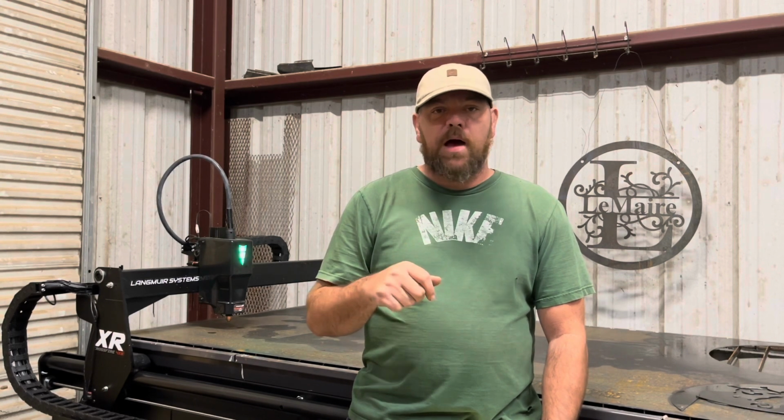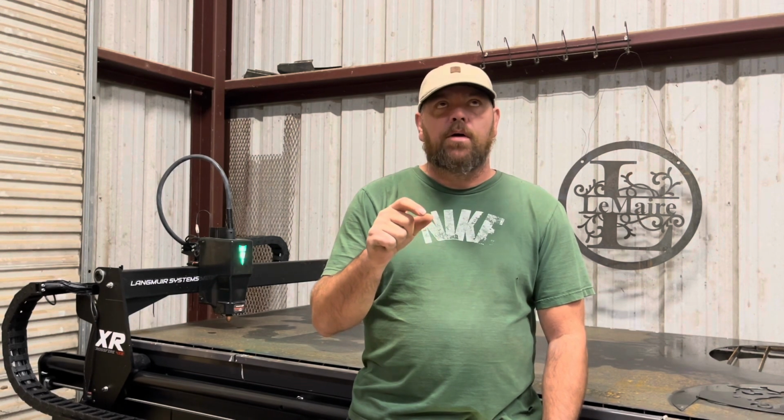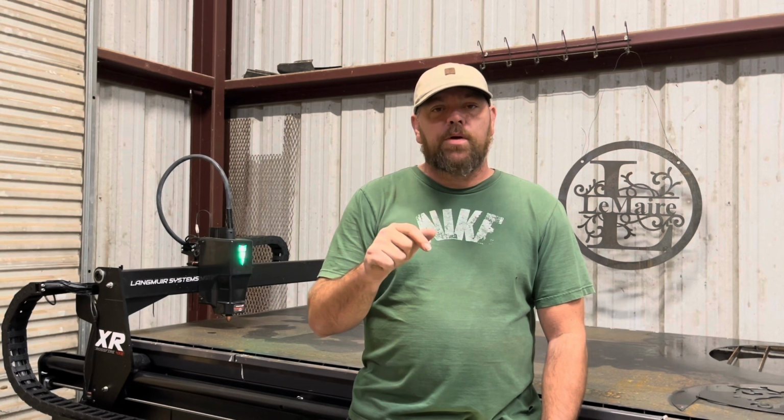Another pointer I'll give you, definitely don't just use the plugs they gave you. Go ahead and, whether it's putting a valve on it or whatever, get a 1/4 inch MPT fitting. What I did is I went from a 1/4 inch MPT to a 1/4 inch to 3/4 reducer into a 3/4 inch pipe to SharkBite, down into a SharkBite 90-degree 3/4 PEX, over to the other one.